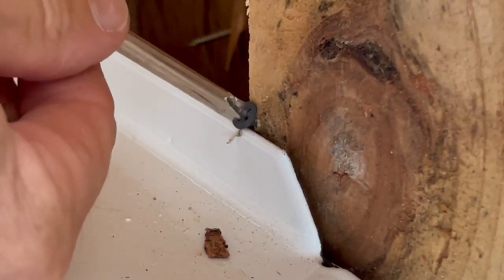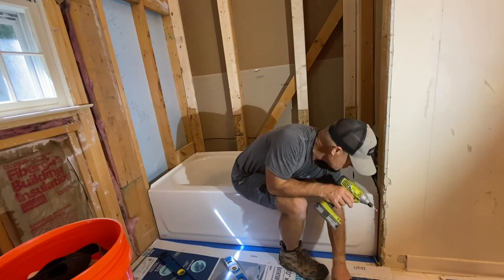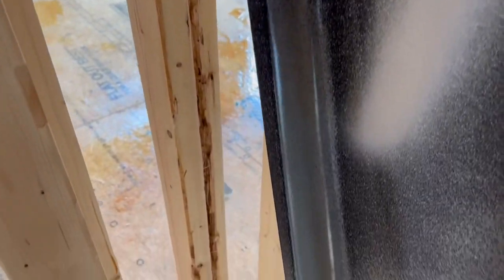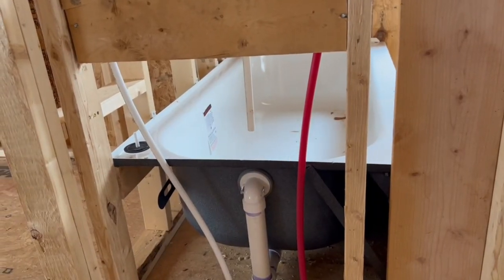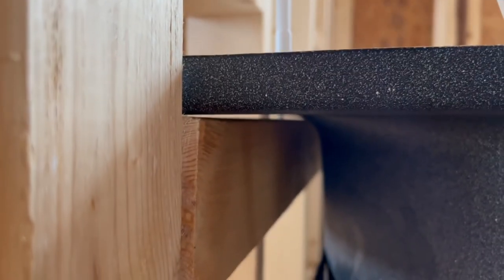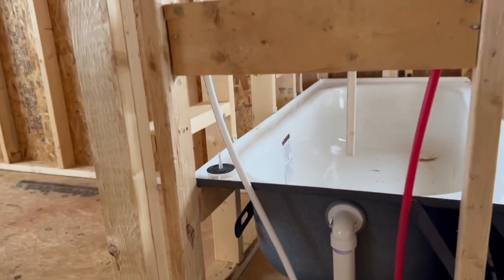In just a second we're going to take a look at some tubs in a house that's being framed up so you can get a really good view of the lip on these tubs. Like I said earlier, they sit on that two-by-four running horizontal in the frame, which is called a ledger. We're going to talk about how important that is. You definitely do not want to leave a gap in between your ledger and the lip of the tub — over time there is no doubt that is going to settle.